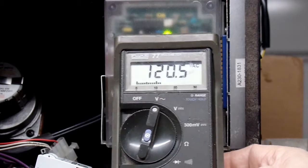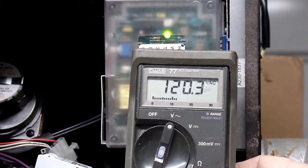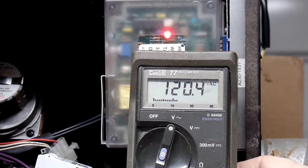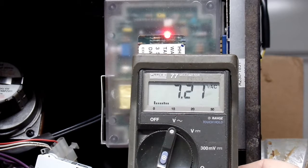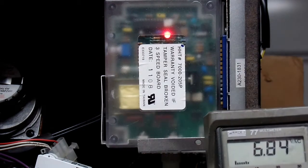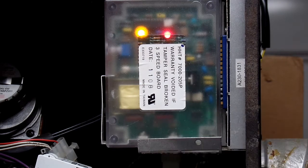Let me see if I can put those two in the same shot. So as I increase — I'm at 200, 300, 400, 500 — and as I approach 600, there it is: 600 degrees. And notice, I've lost my voltage to my heater element, but now my auger starts to drive. I'm at 600 and in steady state. My voltage to my heater element is off and my auger is cycling on and off with the red light. I'm simulating 629 degrees Fahrenheit, so the auger is constantly driving on and off, dropping pellets into the fire pit. The heater element has been turned off, but we have a fire because we're at 600 degrees, shown by the red LED.